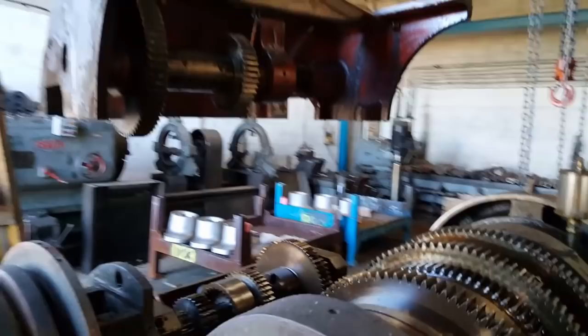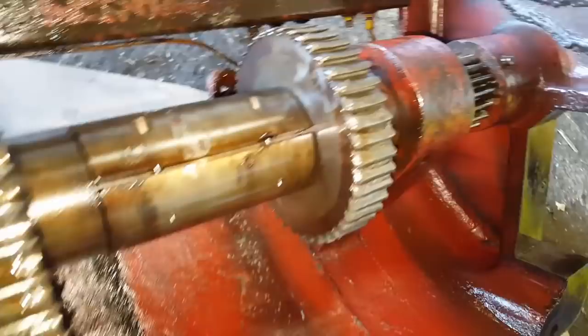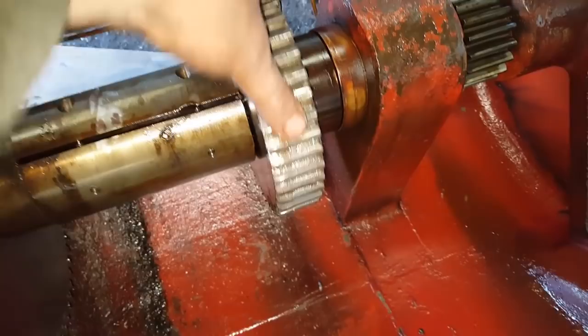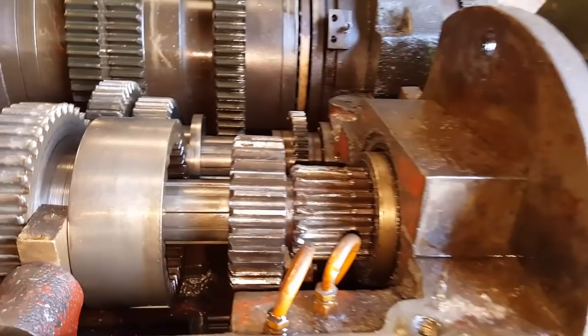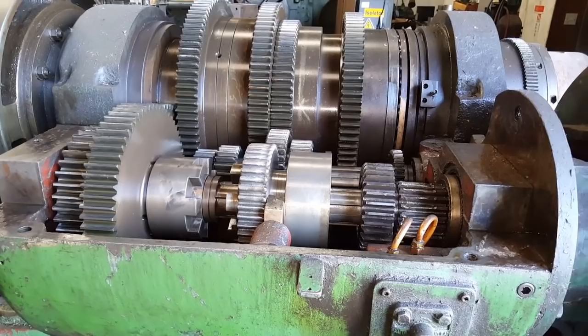Get it on the floor and have a look - this is in a lot worse condition than I thought it were. That gear's totally gone, this one's not that pretty either. Obviously the keyway must have been totally knackered. Also the main drive gear - what I did with this was I removed the clutch because the clutch clip kept slipping, so I just made it a direct drive from the motor, and that's the one that takes the main drive up and that one's gone as well. I'll think about what I'm going to do with it.